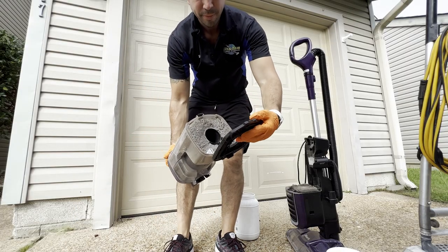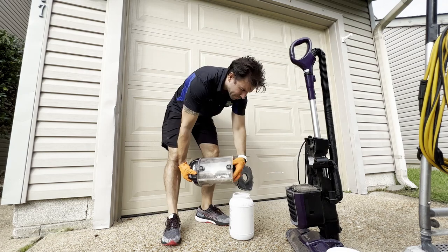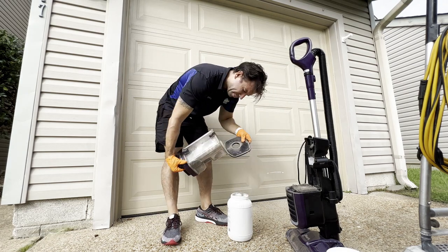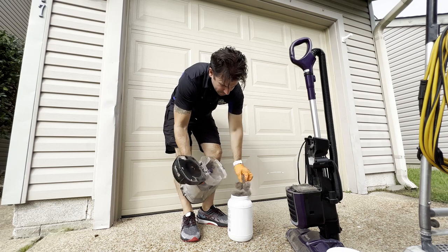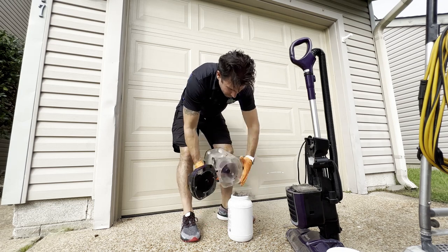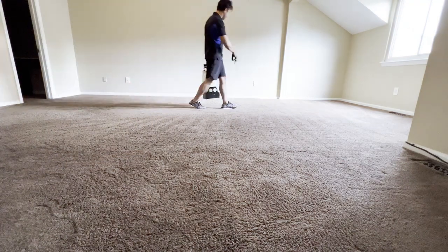I had to come out and dump the vacuum a couple of times — you can see how dusty and how much dog dander there actually was. Imagine if you were just going to go out and pre-spray everything without vacuuming first: it's going to bring a lot of mud in, the hair is going to get stuck in all the fibers, and the carpet is going to smell at least a day or two later. It's always best to get as much out as possible before you start cleaning.